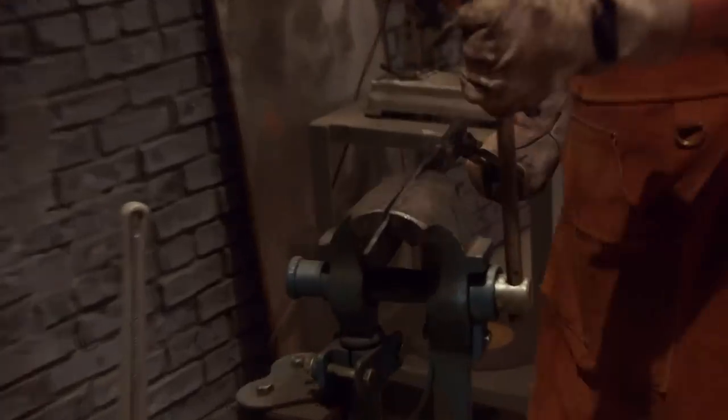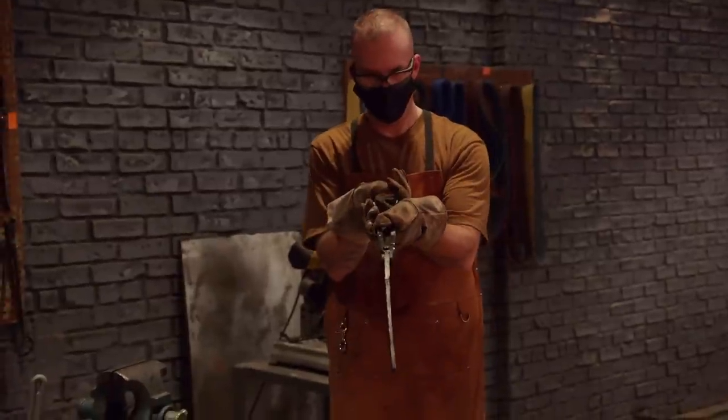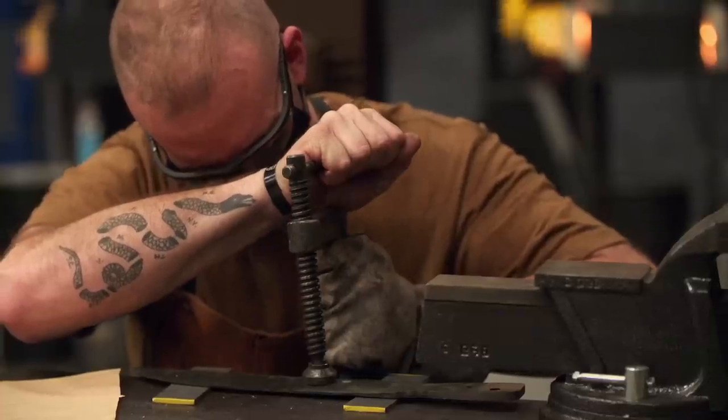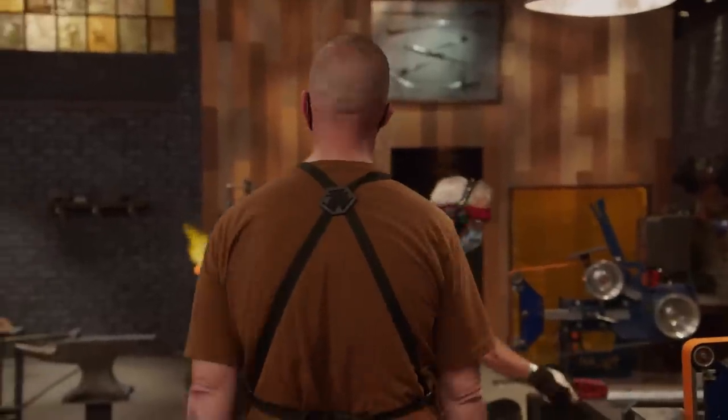Adam's is quenching. I notice a warp start forming — Adam's blade is warping in the vise, really bad. I don't want to go back in for another quench because I don't want to stress that blade anymore, but I need to correct it. What I'm going to do is a three-pin technique. While I'm waiting for this to cool down, there's a little bit of temperature where you can fuss around with it and straighten it. I've already quenched — this is so dangerous. I'm at eye level, looking at my blade, looking at the judges, and I can see them cringe. I'm not getting the warp out as good as I want, but I'm just going to move on because I'm running out of time.